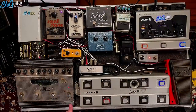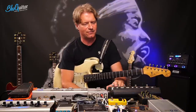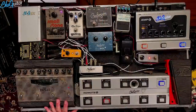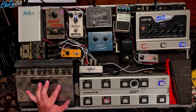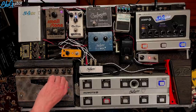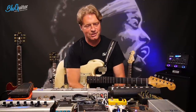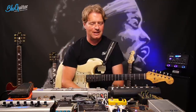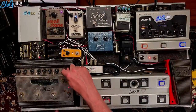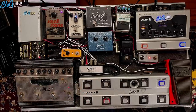Just beautiful. On this side, I have a shorter time, which I use. This 316 kind of U2-ish delay. And the modifications I've done to this pedal are because it's not programmable. I simply put in trim pots here, and I have a selector switch that switches between these three trim pots, so I can preset different times with a screwdriver. I had to do this when I was gigging with other bands where we needed to be spot on, and I had to have timed delays, so I could preset that here. So this switch replaces that pot, and the pot here is then replaced with these three trim pots, but there's no big modification.